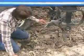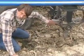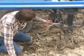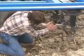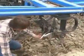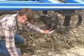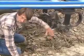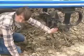Same beveled edge that so effectively parted the soil to the compression thrust side of the tine to accentuate the fracture force is also then, when it comes out of the soil, allowing the side of the hole to actually sharpen the tine. It won't matter how long this tine runs, it will actually get progressively sharper because the soil is actually coming off the side of the tine. That's a function of two things: the angle and the twist of the tine.